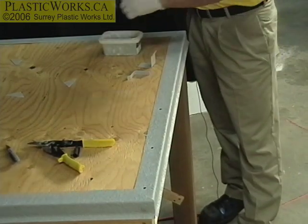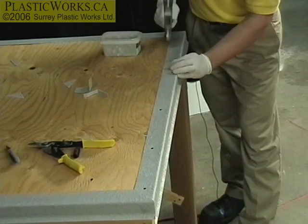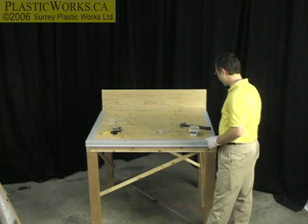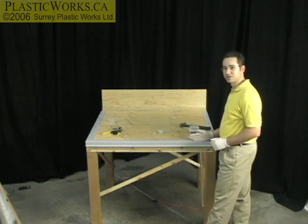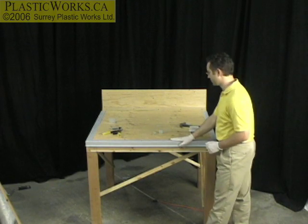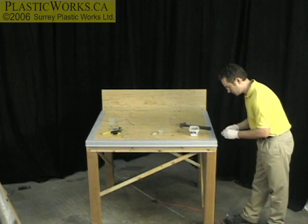And you don't need to put a huge number of nails in. You're really just trying to hold it against the surface of the sun deck. And once you put the fiberglass on over top, it's going to come right up to the edge here and make all one surface. But you can't have the flashing loose while you do that — you need it against the surface. So I'm just going to continue on here.